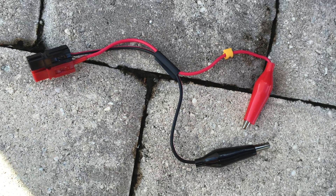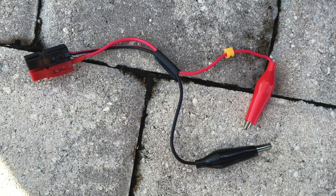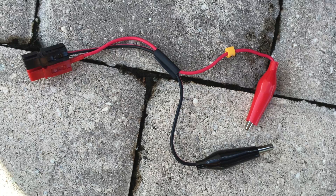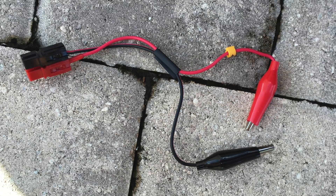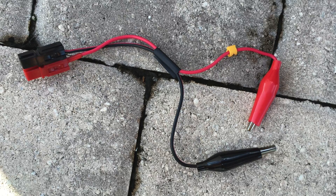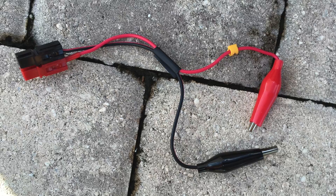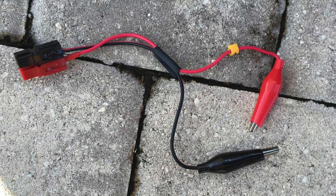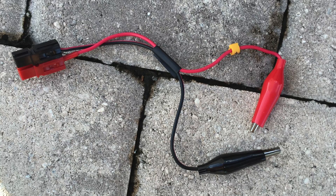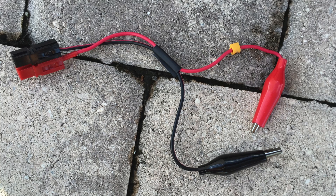Based on a lot of your recommendations, I made a simple fix: I took alligator clips connected to an Anderson power pole adapter so I can swap in and out different endpoints on the solar panel itself. Then I simply jump the battery to wake up the BMS system, plug the solar panel back into the generator, and I'm off and running. It's a simple couple-dollar fix for a challenge with these battery types, and it did the trick.